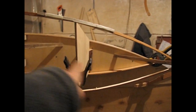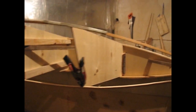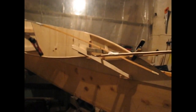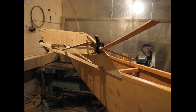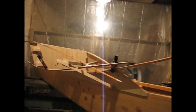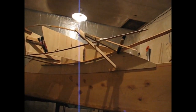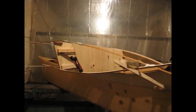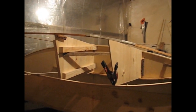I'm going to have to brace this one still before I start sheeting it. I want to sheet it all flimsy like this, get everything in place, and then just weld it with epoxy. Things look slightly more complicated but they really aren't — when you learn how to play around with battens it actually becomes fun. You just have to start looking at your battens and finding a way to hold them, bend them, screw them on, clamp them on. Just do whatever you want — it's pretty freestyle.